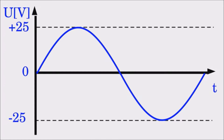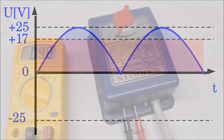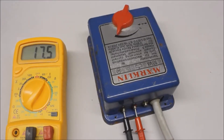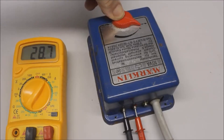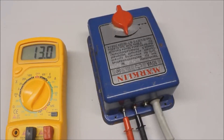Momentarily the voltage differs significantly from 0V, ranging from plus 25V to minus 25V. Therefore, AC voltage is often characterized by the root mean square value. The RMS is a statistical measure of the magnitude of a varying quantity. The AC voltage is rectified by the multimeter and the root mean square value is displayed. To enable that function, you must set the rotary switch to an AC voltage range. Now you can read the RMS voltage output of the transformer. The polarity of the AC voltage alters very quickly and the multimeter rectifies that voltage, thus the value doesn't change when swapping the test leads.